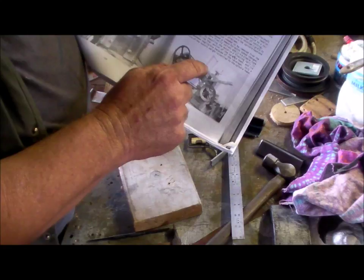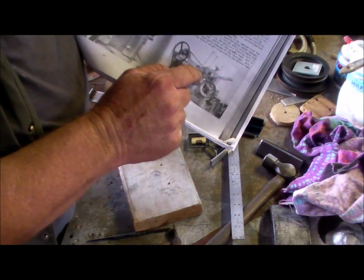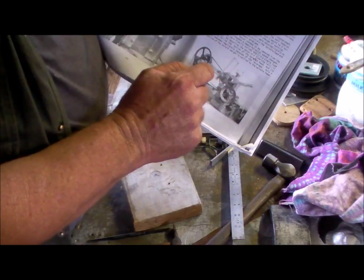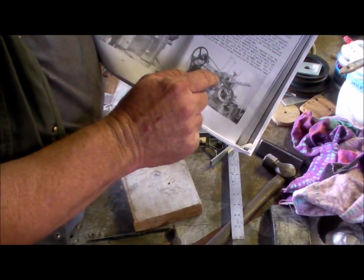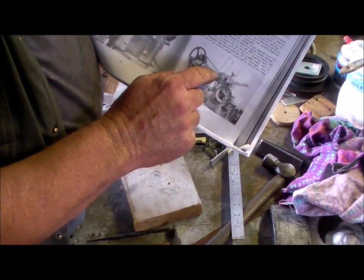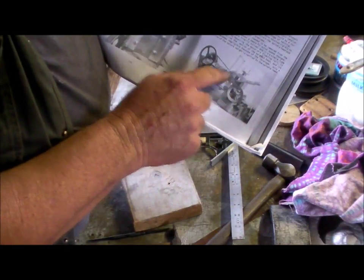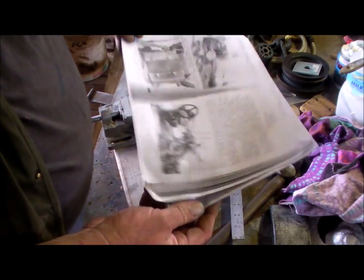These two lever arrangements disengage the tension of the belts. So it's this mechanism that the motor and the pulleys are all sitting in that makes up the transmission. And then the final drive of the transmission is a 2-inch and a 6-inch pulley, which interchange for currently low range, swap them around for high range. So that's what I'm up to.